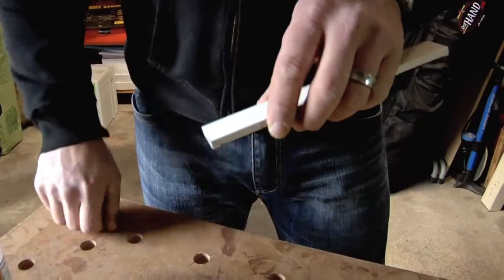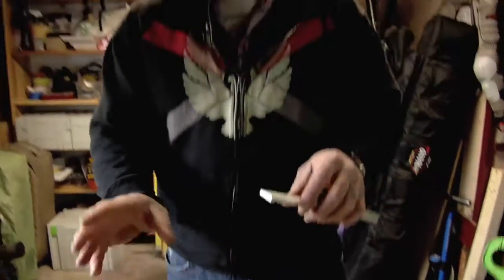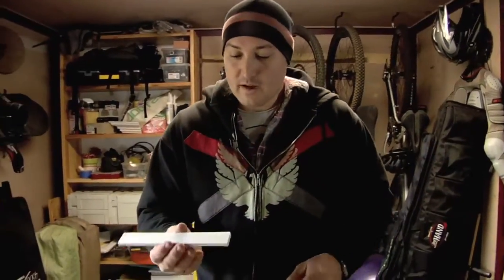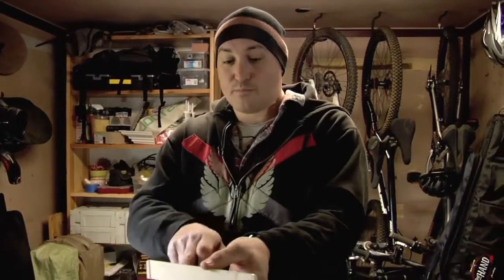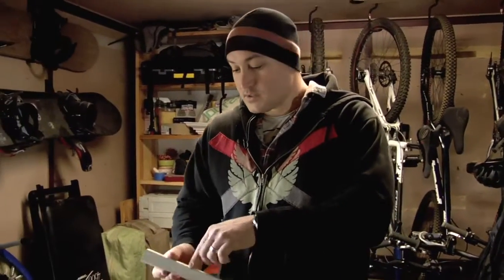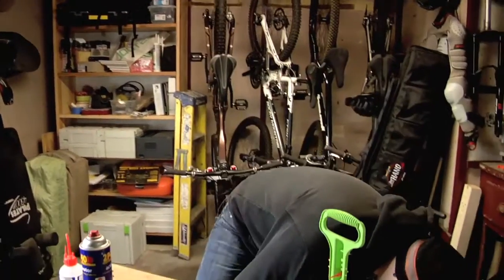You can kind of pick it off, or cut it off with a knife. Just spray it with the activator — it hardens right away and you're not going to stick your fingers to it. That's putting it on the pre-finished white scribe moldings, gluing these ends on real fast. No nails are required. You can either glue it or just use a 23-gauge pin nail to the cabinet, and not so many nail holes.